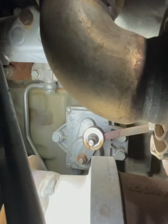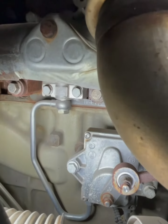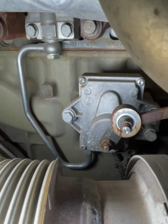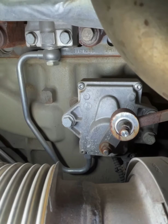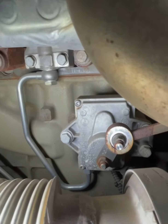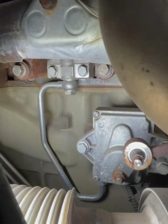All right, that linkage arm has to come off right there. There's a couple of coolant lines on the bottom right there, if you can see that. Those coolant lines have to come off. And then there are, I believe, three mounting bolts holding that EGR valve actuator in place, with spacers on them too, so don't drop those spacers, you're gonna need them again. All right, and that's it. So we got those coolant lines, the arm, the pull rod, and the mounting bolts, that's it.